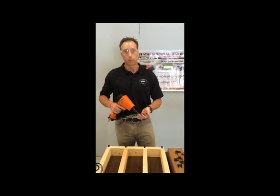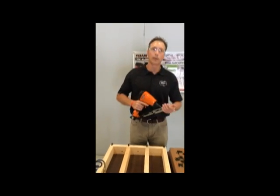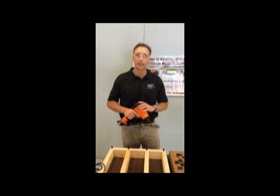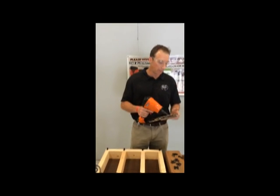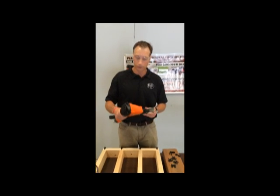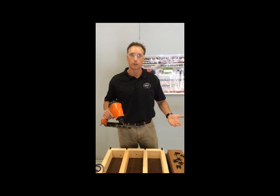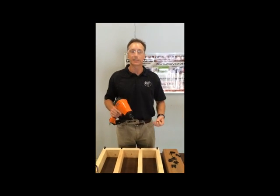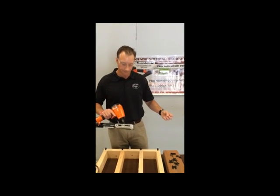Secondly, another complaint of the contractor was that the guys are out there running their nailers at 120 psi, and they don't want to have to go down and change their compressors when they change tools to shoot the deck boards on. So what we did was we came up with a way that we specially milled the driver blade down to be able to use the Eliminator tool, whether it's shooting 75 psi or 120. Great feature. Guys loved it. Speeds it up. They don't have to worry about messing up driver blades or messing up clips. It's just plug and play, basically.